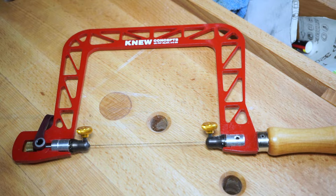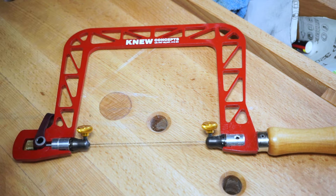Unfortunately, with the Mark IV, they've decided to powder coat the finish rather than anodize it. So yes, it's nice and shiny, it looks great whilst it's new, but anodizing makes a lot more sense because it's harder wearing and offers a lot more protection. It's basically an oxidized layer of deliberately corroded aluminium on the surface, so it is as hard as the aluminium, whereas powder coating doesn't come anywhere close to that.